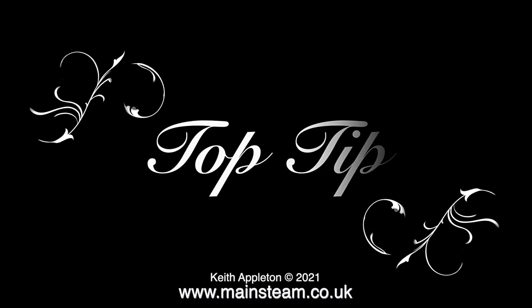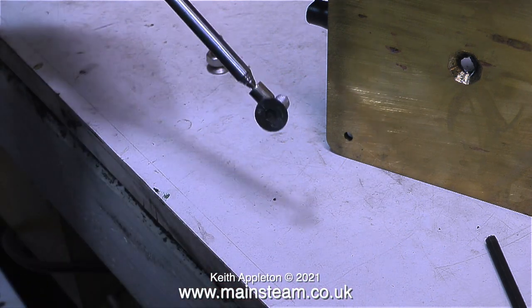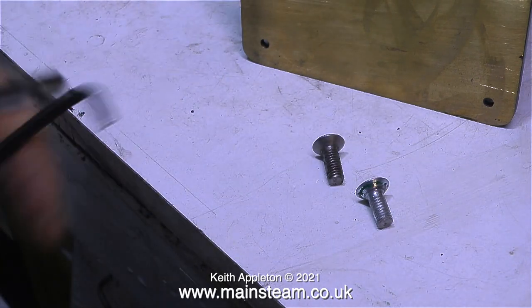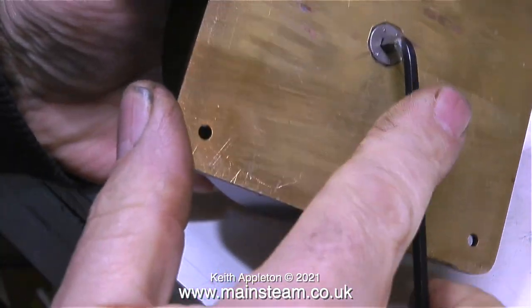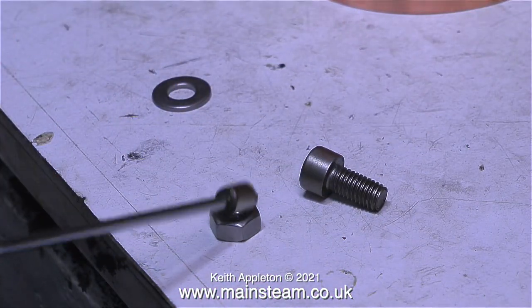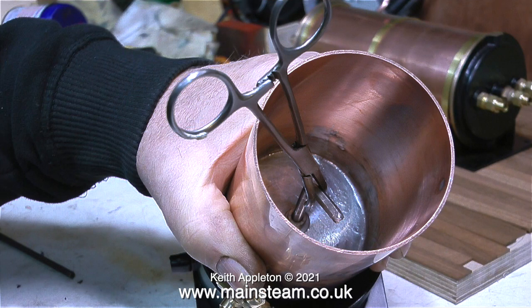As this is a water tank, even though I fitted it with a gasket, I still needed to use a stainless steel bolt to prevent it going rusty. The easiest way to identify a stainless steel bolt is to use a telescopic magnet — any magnet will do. As you can see, the magnet attracts the regular bolt and the allen key, but this stainless M6 allen cap head bolt is non-magnetic. Not all stainless steel is non-magnetic, but this bolt, washer, and nut are non-magnetic and therefore stainless steel — perfect for holding the water tank components together.